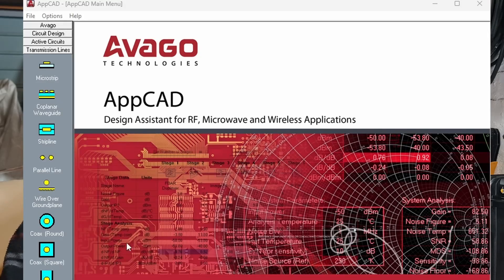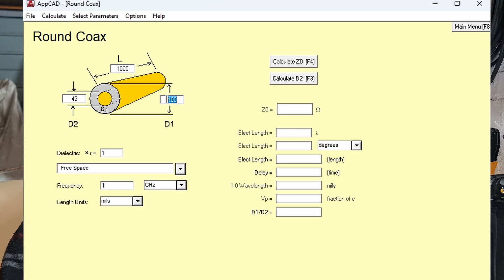The centre post itself is fine, but I'd like to upgrade it to a coaxial centre post. I've already got pieces to make a 50 ohm centre post, but there are some logistical issues around how to insulate the centre conductor from the shield. So there are still some minor issues I need to sort out.